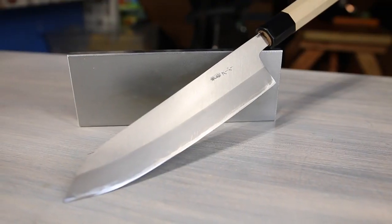If you need to repair chips on a knife or grind away a certain part of a stone that's worn out, the 400 is great for that. If you are the type that likes to flatten your stone more often, the 600 would actually make more sense because it takes off less material per stroke and it's also a finer stone. Some people like to go through a whole range of grits — 400, 800, 1000, then 3000, 6000.